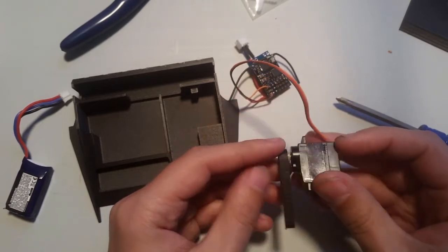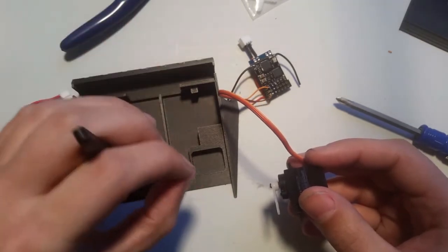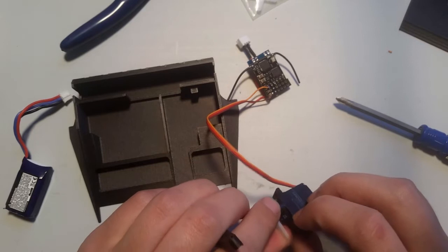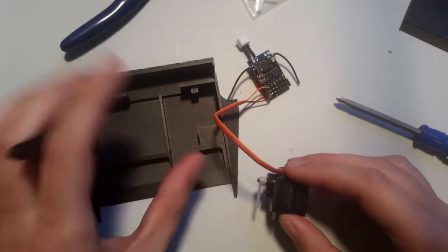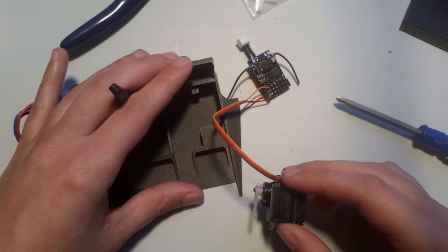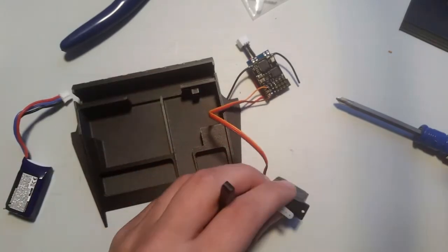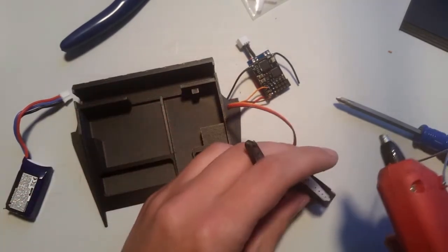The arm, when you're using it, you don't want to actually physically force it when it's powered, because this does have metal gears, but they are small, so you can strip them out and break the servo. In combat, that really won't happen because the weight of these is so small that it's not that much force, even if it's dropped on it or whatever, but you can physically force this for way more than the servo is rated for, so you don't want to force it with your hand if it's powered and fighting you. I'll show you what I mean later.